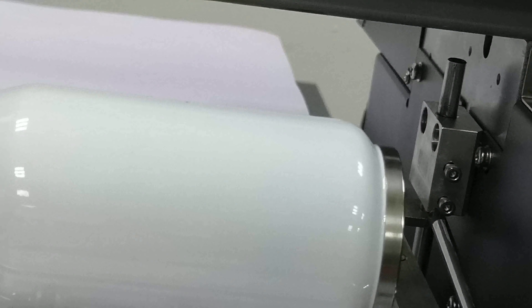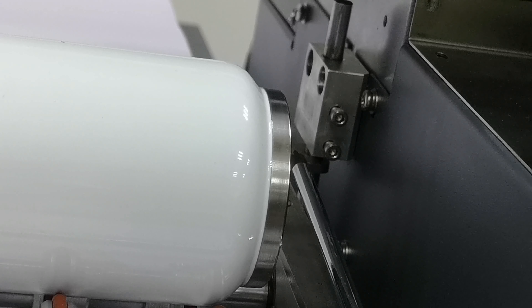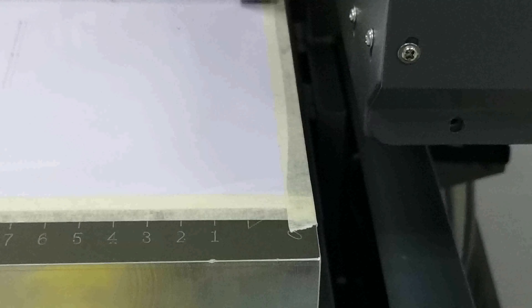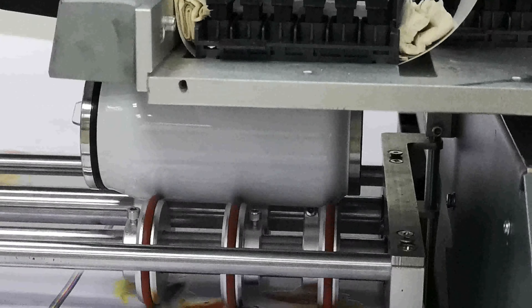Put the bottle on top of the gears, then go to the software to move the table up. You must move up little by little — it cannot go too fast because the up-limit sensor is not working when you print with the rotary device. Move up from the software little by little, three seconds at a time. Pay close attention to this gap — this metal part cannot go over the aluminum part.